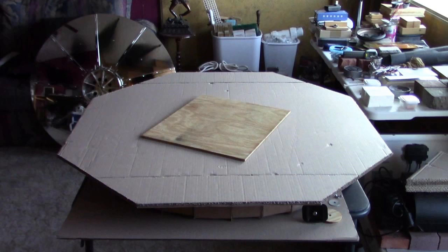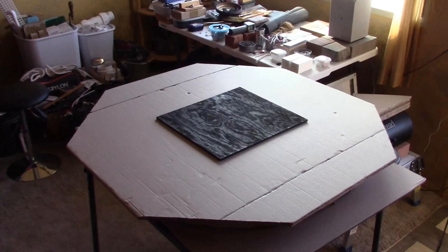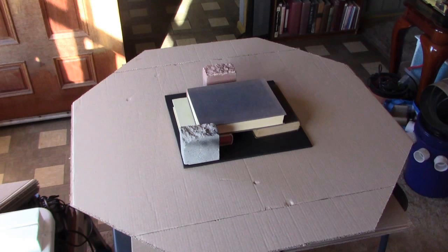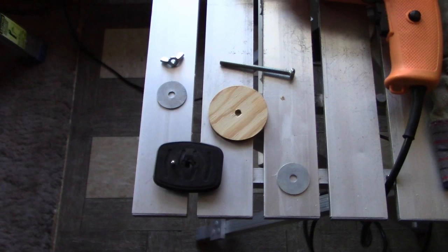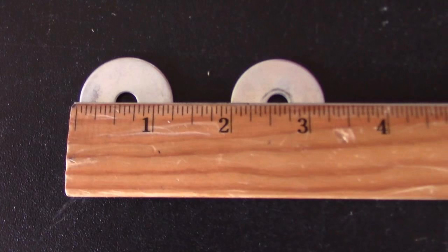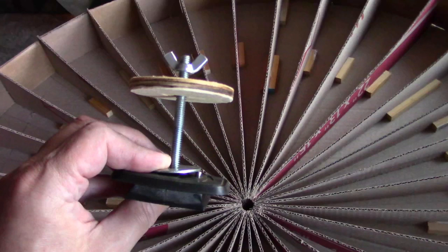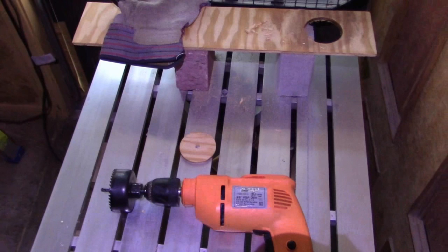The next thing is to add the back brace and center hardware. The back brace is just a 12 by 12 inch, quarter-inch piece of plywood — glued on with liquid nails. All you need for the hardware is one 3-inch long bolt with a wing nut, two 1 and a quarter inch washers, and a plywood disc. Make that with a 2 and 3 quarter inch hole saw drilled into a piece of quarter-inch plywood, then sand that piece down.